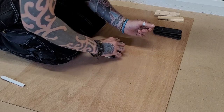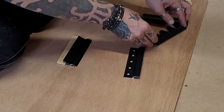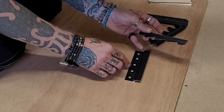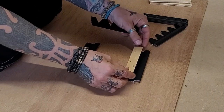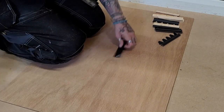However, a bit of advice is to basically either drill some holes in the bar or cut some V notches out. That means that when that goes onto the floor, the adhesive underneath will squeeze up through, and then once the gripper goes on top, again, more adhesive, it's getting a better contact. And put that for demonstration purposes.